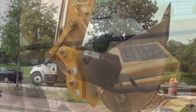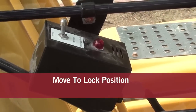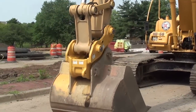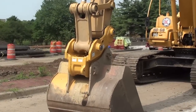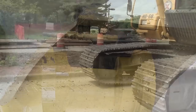Come to full curl position with the bucket or attachment slightly off the ground. Once at full curl, then and only then, activate or move the switch or push the button while continuing to hold the bucket curl lever over center, building hydraulic pressure to max relief for three to five seconds. Place the attachment on the ground and perform the ground test as previously stated. You can curl the stick in closer to the cab and raise the boom up to see the slide in the lock position underneath the pin as it should be.